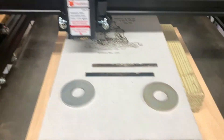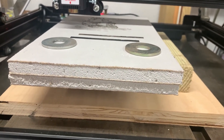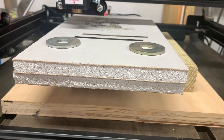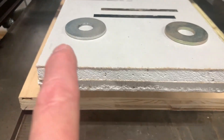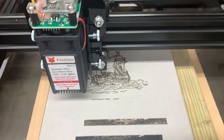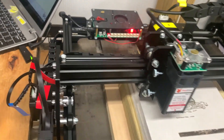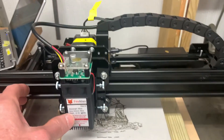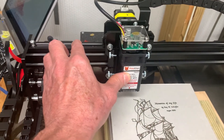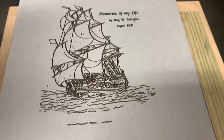What you're seeing here is my test pattern. Some of the YouTubers are probably going to take exception to this, but I thought what a great idea — half-inch-thick drywall. There's gypsum in there, which I don't know burns readily, but it's paper-coated and the paper will burn real easy. I'm going to shut the servos off — I've got the controller on so I can move this by hand. There it is; now you can move your axes. This is the 20-watt head, by the way. I'm already done printing my test and you can see it was relatively easy.